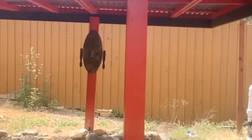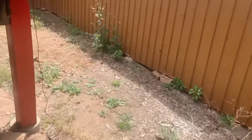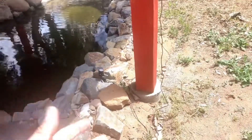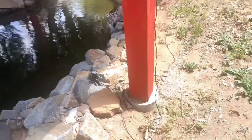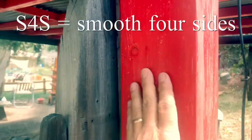So that post is going to come out. Now, I'm not going to put the new post down in the concrete because termites will find it. And even if I do a pre-treatment, I don't want a bunch of termiticide near my fish. And I'm not going to use pressure-treated wood because it's ugly and it twists. So we got number one grade or better Douglas fir, six by six, S4S — which means smooth on four sides.